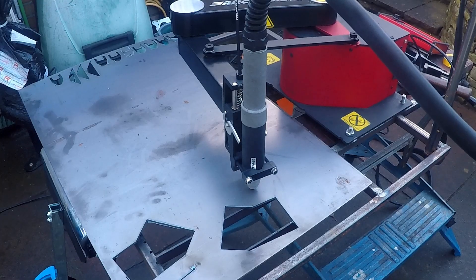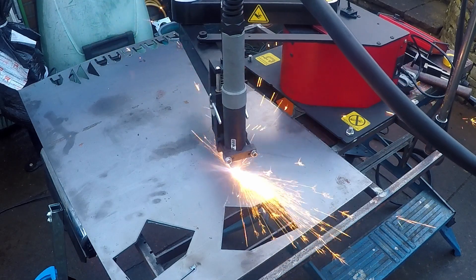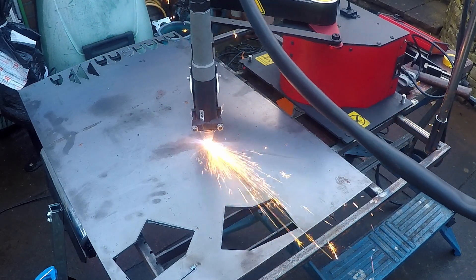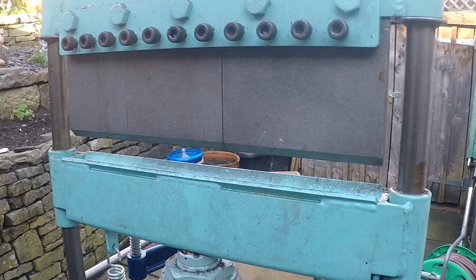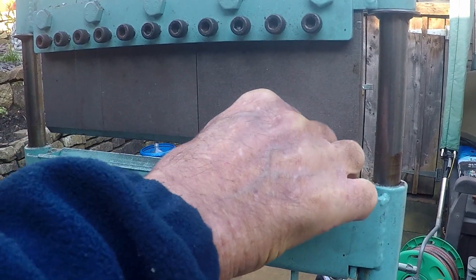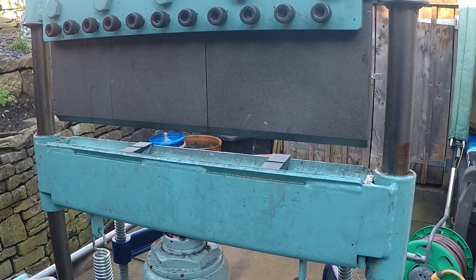So another low power cut to make two grooves this time for the bending alignment. Here I am placing the alignment guides into the V groove of the bender. I had to make a couple of tries at these to get the dimensions right, but in the end they fitted okay.